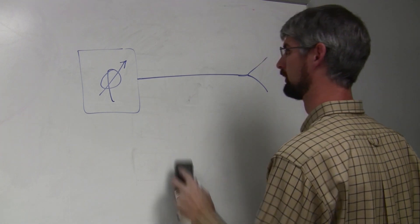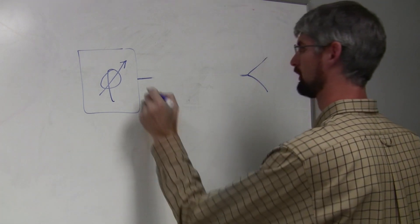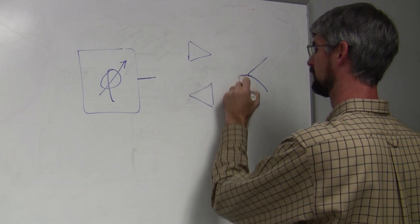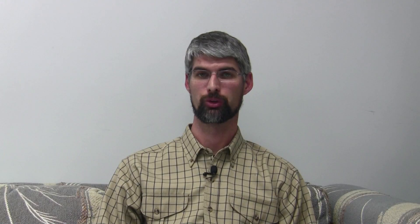An active electronic antenna is a little different from a passive one in that instead of just phase shift drivers, it also contains the amplifiers for transmit and receive in each of the elements. This can provide a number of advantages, one through just integration of the whole system — both transmit, receive, and antenna all being combined together. It also provides the ability to look at a number of very advanced features, which we can look at in a later video.